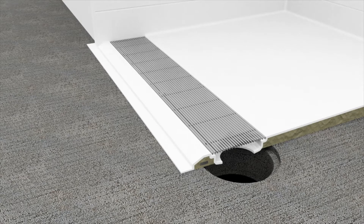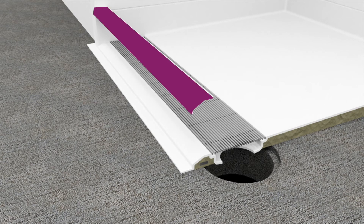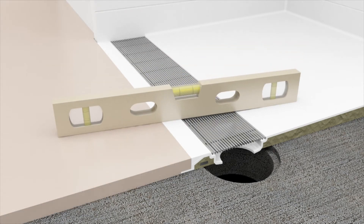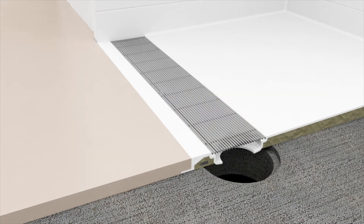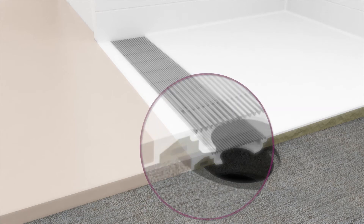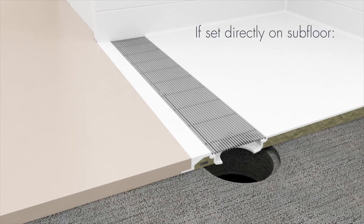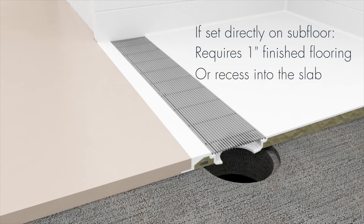The grate is offered in powder coated white as an option, with stainless as the standard. The change of level threshold is highly specialized and may not be the preference for some developers. The Freedomline Trench collection can be modified with a vertical transition strip bonded to the change of level threshold, converting it to level. This conversion strip will modify the installation technique and require different finished floor requirements for meeting code. This will raise the total height from one inch to one and a quarter inch. If this shower is set directly to the subfloor, the finished floor will need to come up one full inch to meet code, meaning most installations will be recessed into the subfloor.